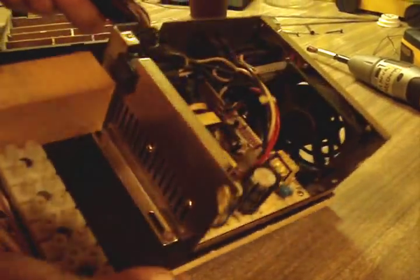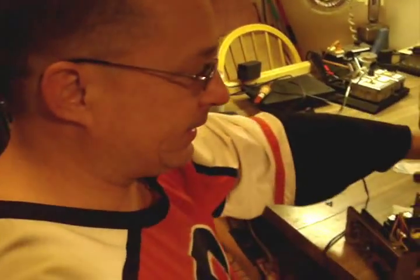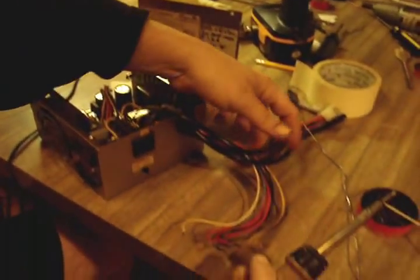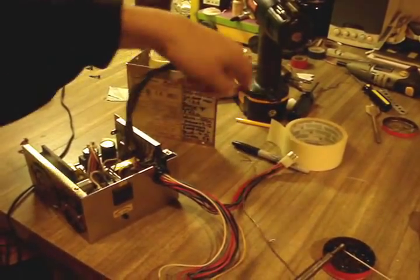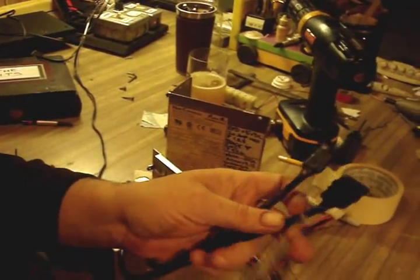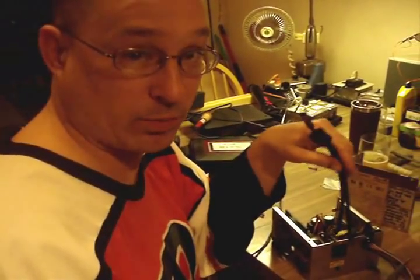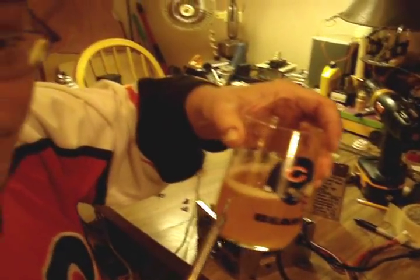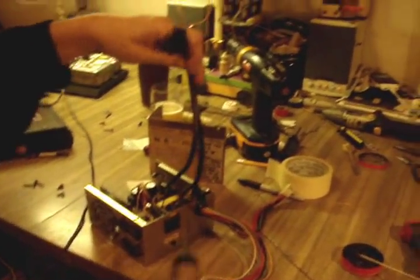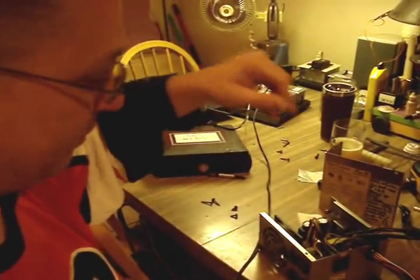I labeled this a little more clearly. When I was testing it, I noticed these two cables weren't listed on the pinout sheet on the unit — they were putting out 110 volts, which I don't really like. AC doesn't mix with water, and I'm pretty sure there's some water in here. So I taped them off, took them out of the grommet, and I'm just going to coil them up and keep them inside the chassis. I think they'll be fine in there.